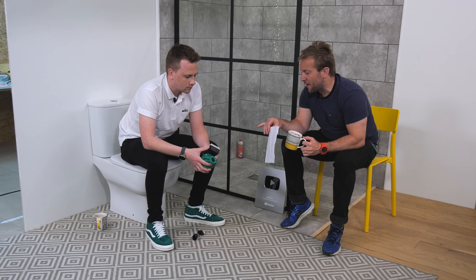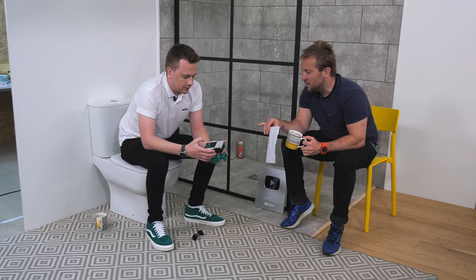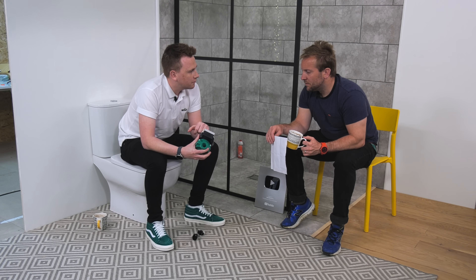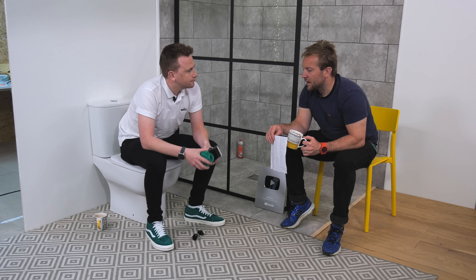Is that almost that slow start function? So now they've got really high starting torque, but also if the pump can't move, it comes up with an error code and it stops trying to run the motor, so it won't burn it out.